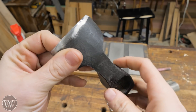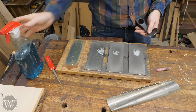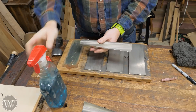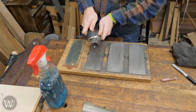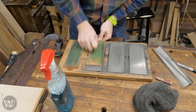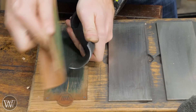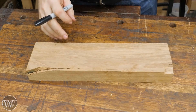I purchased this bowl adze on Etsy from a guy in Germany, I believe, and I've been wanting to get it for a while. It is a hand-forged head - an older one that the last person who owned it did a good bit of work on that wasn't quite right. So I'm going to sharpen it close to where it should be sharpened. I'm not going to hone it down completely because I want to do some work on it still. We're going to go through all my stones and then strop it using the inside and the outside. A bowl adze actually has a bevel on both the inside and the outside, so you need to make sure you're doing both of them rather than having a flat on one side and not on the other. So now we can protect it and get to working on making a handle for it.